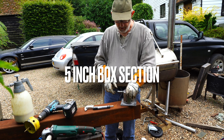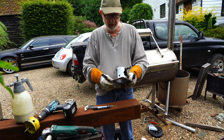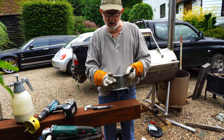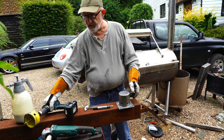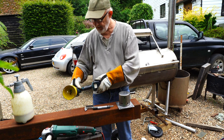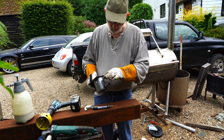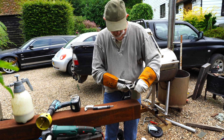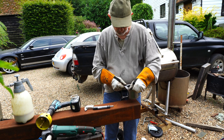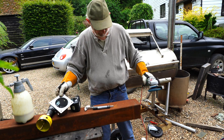We're going to be fitting this burner pot. Now this is a stainless steel one — it is 89 millimetres diameter, which is three and a half inches. I'm going to be using this hole cutter which is three and three-quarters inches, or 95 millimetres. The reason we want that is we want a little play on this, so when we've got the tube in we can push it over and then screw it down so it locates nicely and we can take it out easily. So the first thing we need to do is clean up our metal.